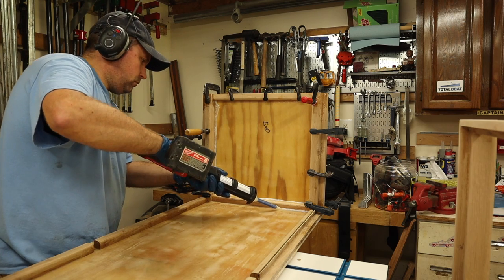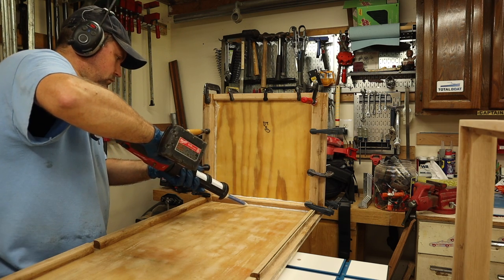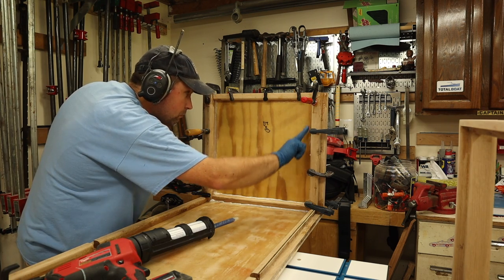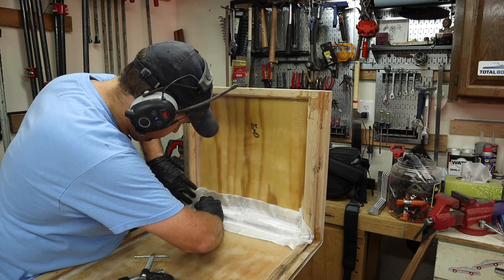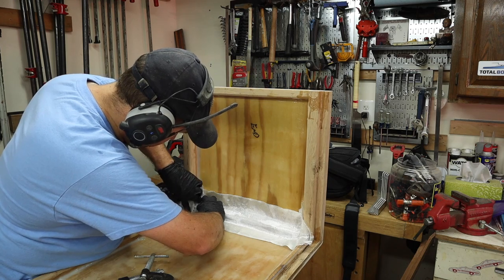Everything will get layered and coated with epoxy and fiberglass tape. We used a generous amount of Thixo pre-thickened epoxy to help soften those inside corners, and all in all, it went pretty well.